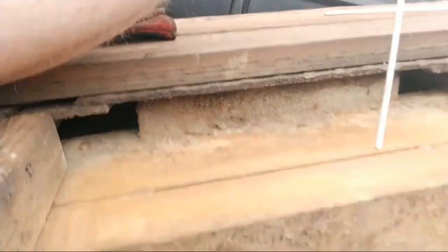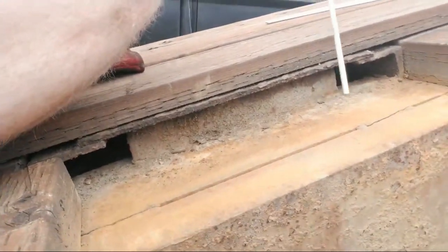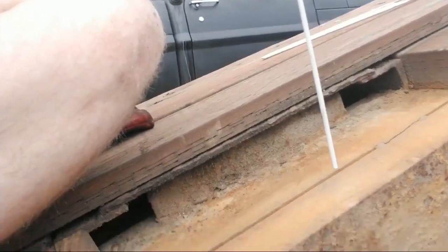Or you got the tap method, which is you basically go like that, and you want to pull it up. I want to say about 1/4 to 1/2 inch. When you tap it, you want to be up. When you're all the way up on the strike, you want to be about 1/2 inch above until the welding arc is a good welding arc, and then you bring it down in there, and you're close.